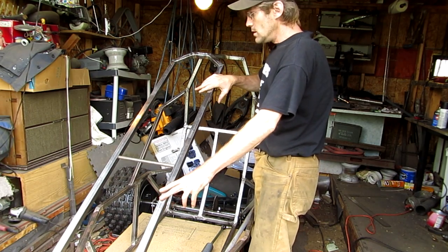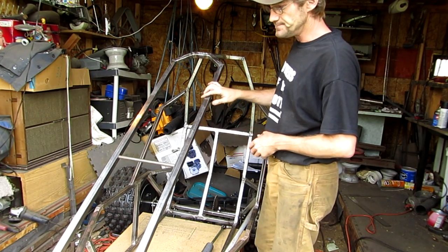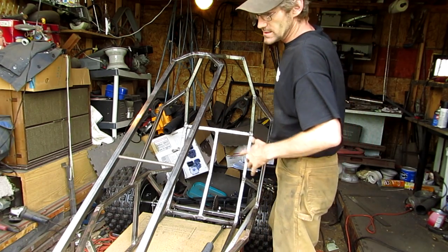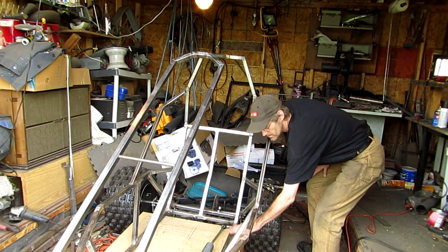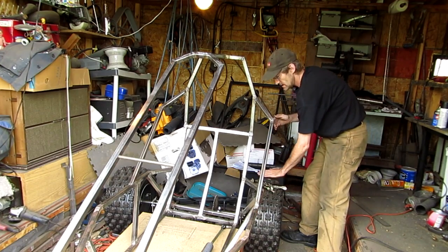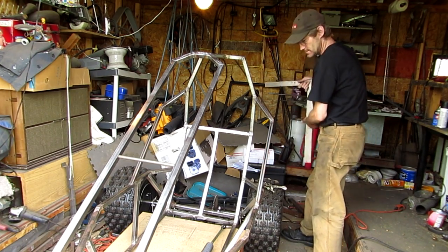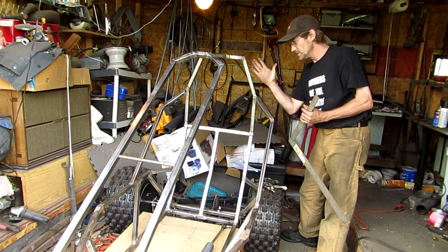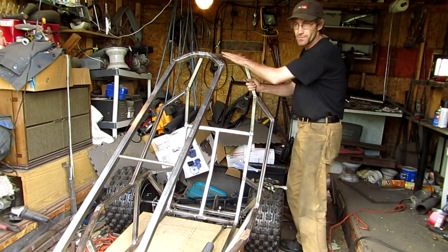This part was too long. So I got into it, looked at the plans again, measured everything out — everything was correct. The thing is, in the plans they're not done too carefully; they don't deal with tolerances and that kind of stuff. And I noticed from the very bottom frame to this back part here, because we've got all these multiple angle cuts, measuring straight out and straight up should be at a 90-degree angle. But when I stuck my square in there and came up, my back piece had flexed forward — literally almost an inch and three-eighths or something like that.